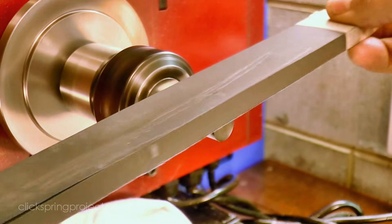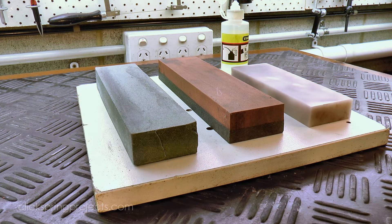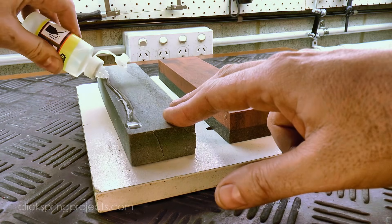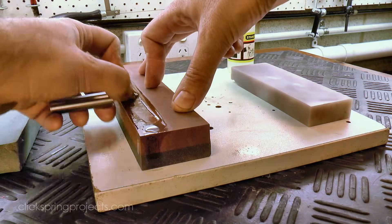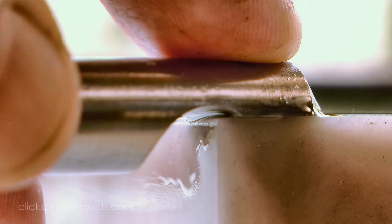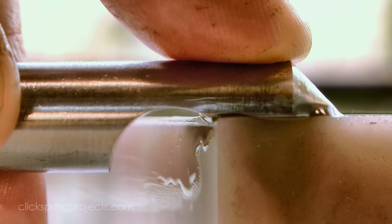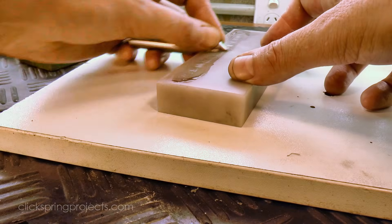Emery sticks can again be used to brighten up the surface, and the cutter is ready to be sharpened using the coarse, medium and fine oil stones. You can see the recess ensures that the cutter naturally sits flat on the stones, so that the entire surface is being sharpened parallel to the axis of the cutter. After sharpening, the flat ends up just a few hundredths of a millimetre short of the centre line, at which point the cutter is complete and ready for use.